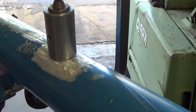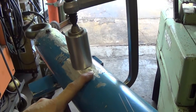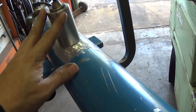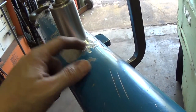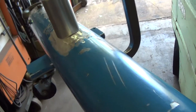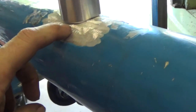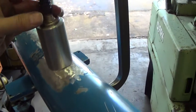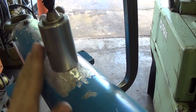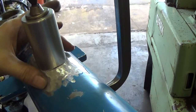All right, I'm pretty well set up here now to do the welding. I've got it clamped in position. Again, like I said, that's why I milled that little thing. It's just to register it on there. It's not really a fish mouth. Not that you'd need it, because it's such a large diameter pipe tube that it's just not necessary. So this is going to be fine. And again, with the heavy wall here, plenty of surface contact to weld.